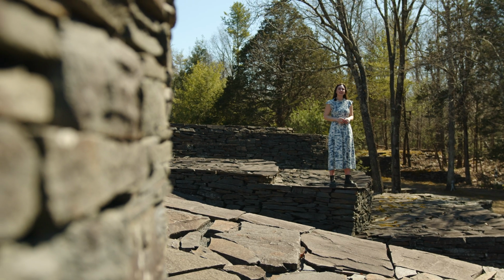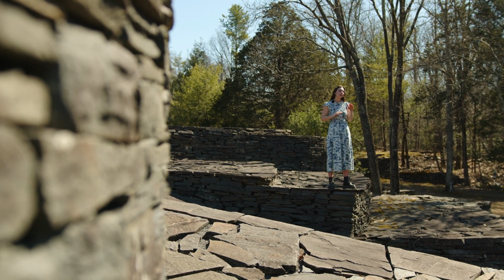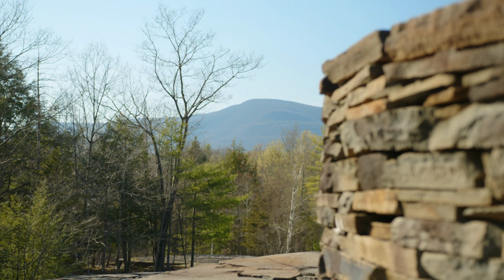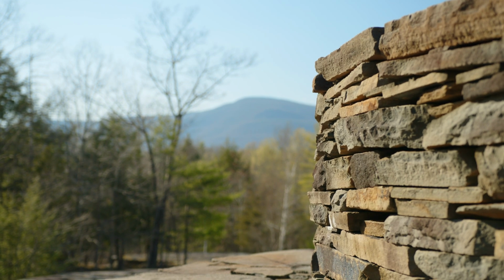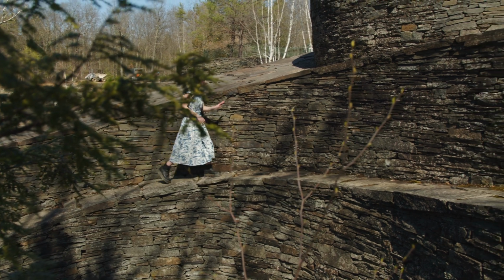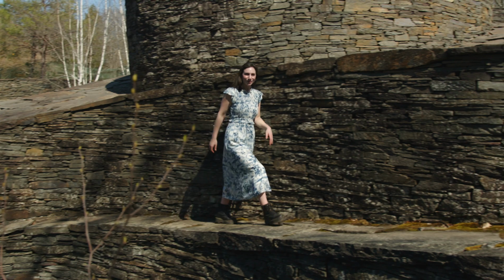According to the dry stone technique that Fite observed in Maya architecture, flat slabs of stone are carefully layered on top of one another. Then, these horizontal stone keys are strategically placed to reinforce the structure, so there's no need for a fixative, it's just stone. Plus, the space between the stones allows for the free flow of water, which makes it less vulnerable to the elements.